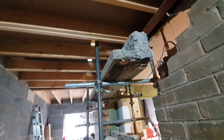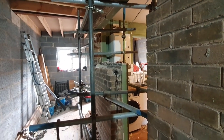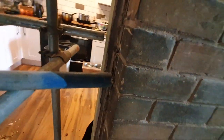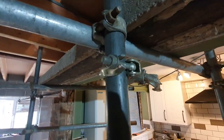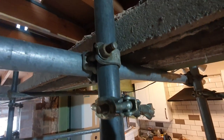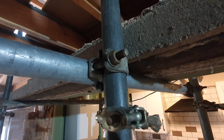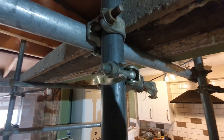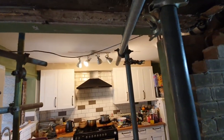The idea of getting this down is not an easy one. As you can see, we've built a tower scaffold, and this tower scaffold is locked into certain positions so it can't move - locked into the wall. Then the idea is we throw fittings underneath, and the fittings holding this up act as backstops. We slowly loosen these off so they slide down an inch at a time, or maybe 50mm, two inches if we're lucky. I've just done the other side and that went down quite rapidly.